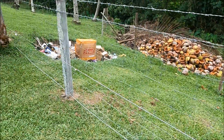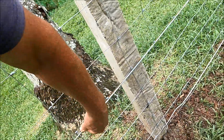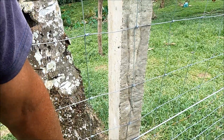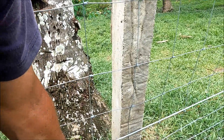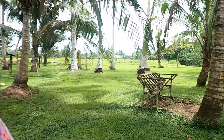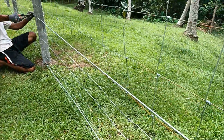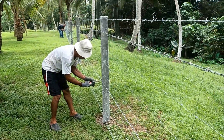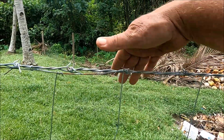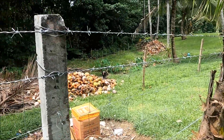We've got the thick barbed wire stretched out across here. We're coming down four and a half inches - we've checked on the other fences where they're rubbing and that's going to be a good height to keep the fence secure. Coming down five from the top, we can clip the hog wire all along here. So we've got the hog wire, thick heavy duty wire at the bottom, thick heavy duty in the middle, barbed wire on the top - you can't slide through or over the top. Nice and solid!